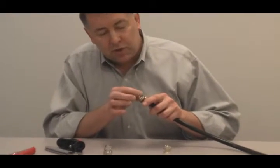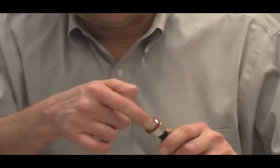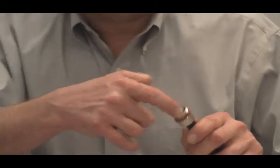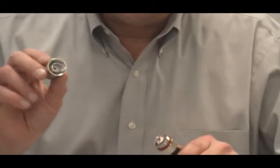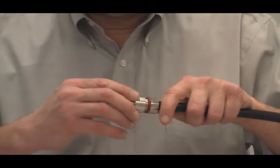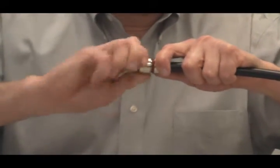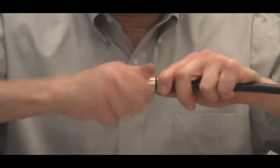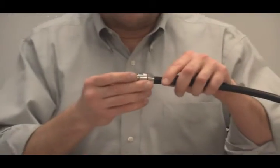You don't have to take too much care here — all you need is any gap at all. Just take your finger and run it around clockwise or counterclockwise around the circumference. The forward end of the connector has a fairly sharp bevel that will come in and work its way between the outer conductor tape on the core and the braid wire. Then just place that forward section onto the connector, make contact with the center conductor, and turn that forward section.